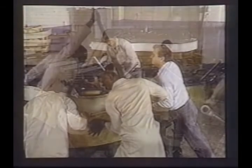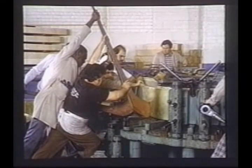What makes this unique bending process possible is the fact that the 3/16-inch maple laminates are thin enough to begin with, and they're lubricated by the still wet glue. It is painstaking, it is difficult, but it shapes the best rim in the world. They work around from the center outwards, tightening the clamps.